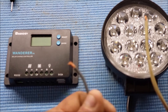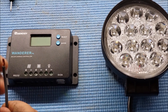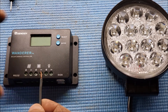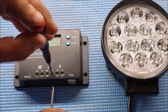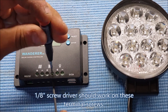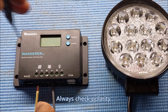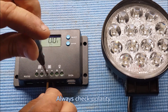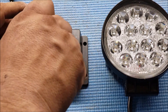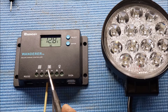With all charge controllers you always want to hook up your battery first. I got the wires here and you can use some in-connectors if you want — I'm using regular bare wire at the moment. I'm going to put my ground here. I'm using gray or black as my ground; some people use black as power, so you always have to double-check your voltage.